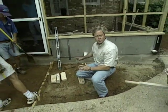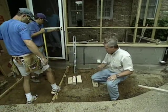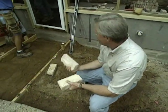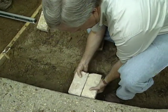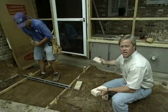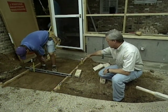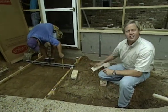I think it's a great idea to plant some shrubs and some flowers in here to really create a nice warm entryway into the porch. But what we suggested is to have the brick mason use the same bricks he's using on the wall and to lay a little header course all along here and on the sidewalk itself. The carpenters are in the process of putting down a real thin slab and footer so that the bricks can be attached to that tomorrow.